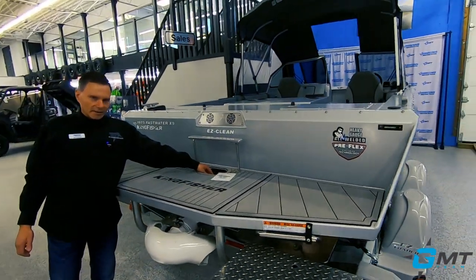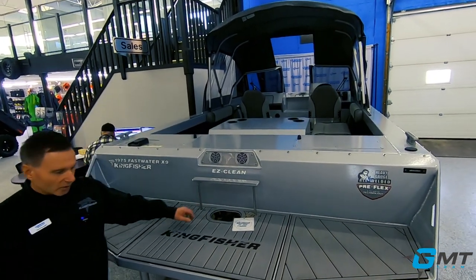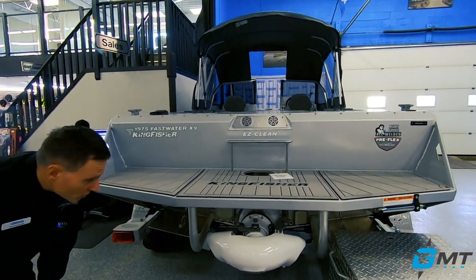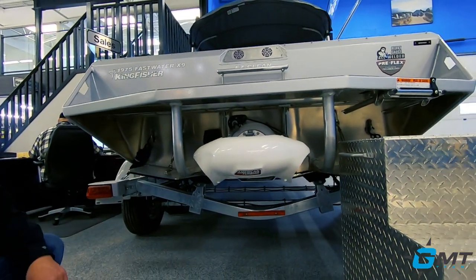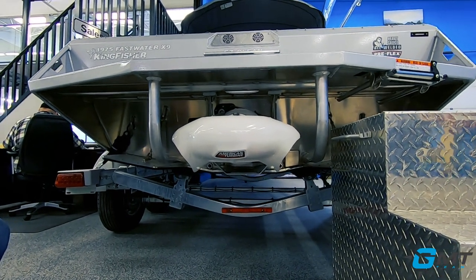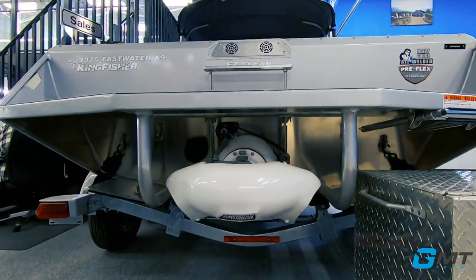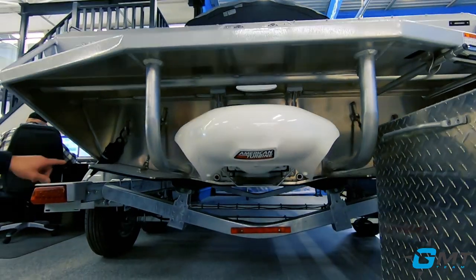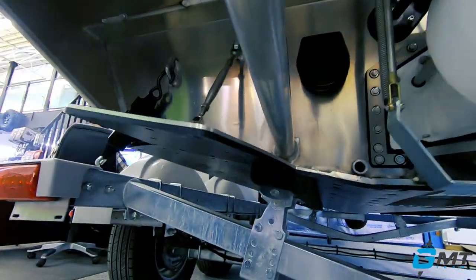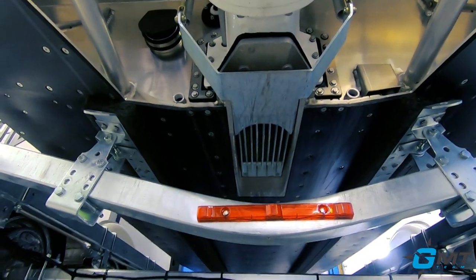You have access here to get at the Turbine 309 pump, so your access port is easy to reach if you end up with any debris in your impeller. This boat has the optional SDR — the split duct reverse bucket — which gives you much higher thrust in reverse. It's got an optional stainless steel A-impeller, mechanical trim tabs in the back, and the extreme heavy duty easy clean as well as full UHMW with large reverse chines on the hull.